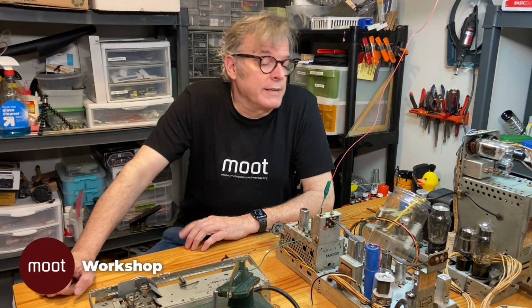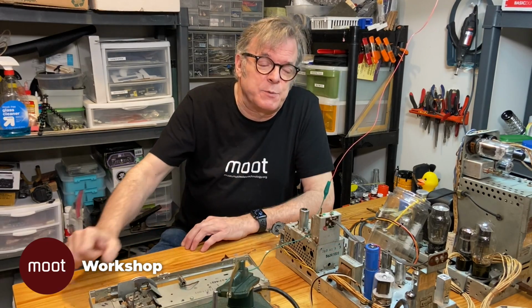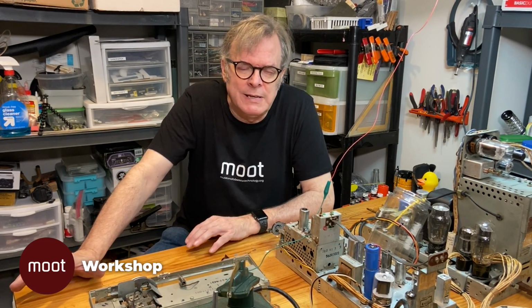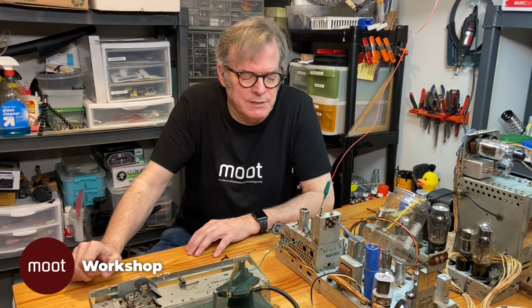Okay, so where does that leave us? The next thing I could try is maybe swapping out the speaker. I don't have an exact replacement for it. It's 3.2 ohms. I don't have one like that. I could probably come up with something, but it would take a little time.